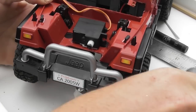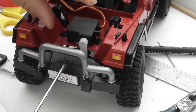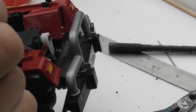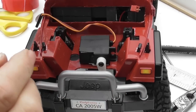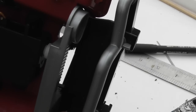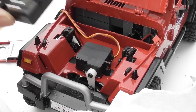I'd better test it though. You would always make sure you've previously linked up the servo and set it to neutral. The most important thing is that there is clearance between the servo and all surrounding plastic both at the back and at the front — which is why I had to trim some off here previously. Pushing it in place, I can see I've still got a gap between the servo horn and the front.